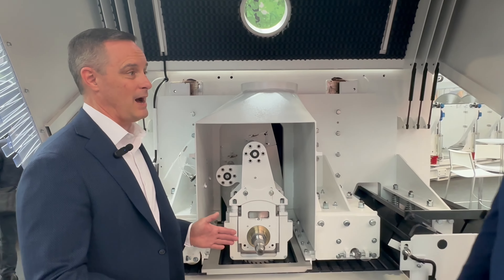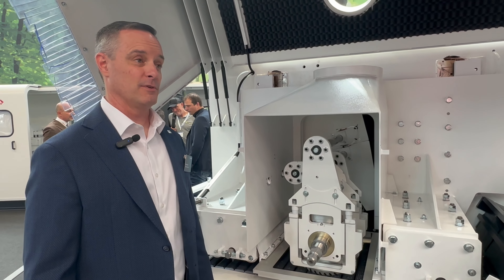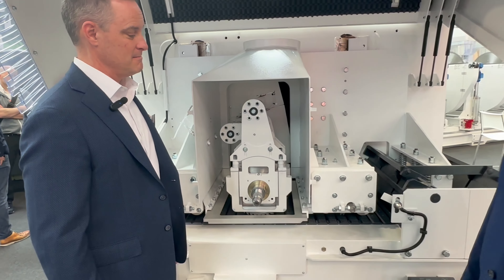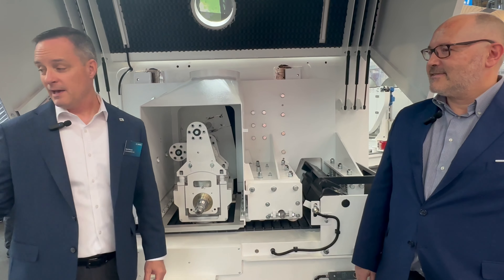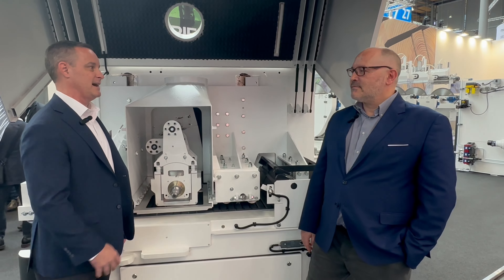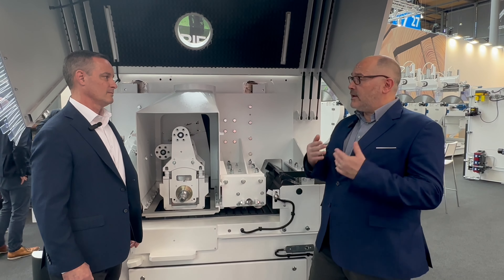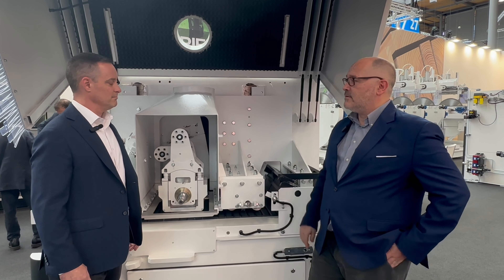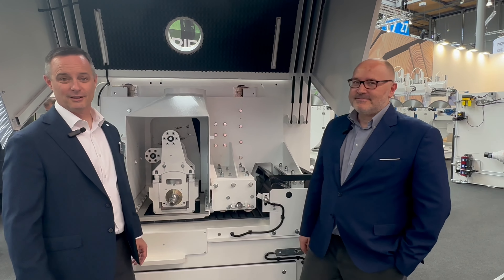That's pretty fast. For us, that's about 18 inches wide, 80 meters a minute — 260 feet a minute. That's really cooking. So this is definitely the big sister of the E-Class machine. This machine is very versatile. It can fit into a lot of different industries. So if the customer had a need of the E, but a little faster and a little more capacity, this would be the ideal machine. On the E machine, we are at 80 millimeters maximum thickness. On this one, we can reach 90. Excellent. Looks like a great machine. Let's take a look at some other machines.